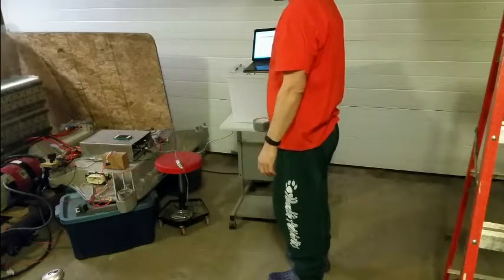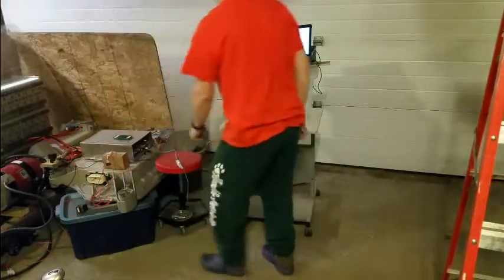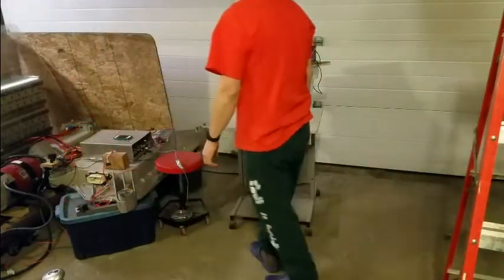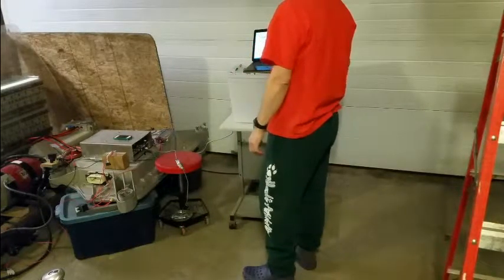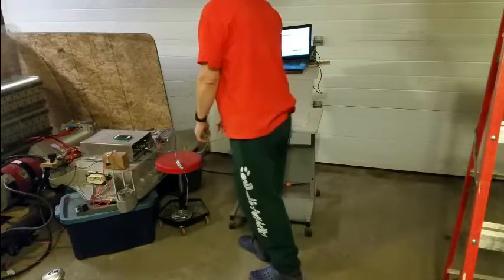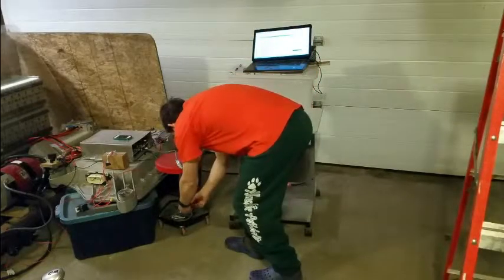I'm going to load the new firmware in now and see whether or not the AC controller works well with the throttle that I've got. I should have turned it to a neutral position according to the settings before I let it turn off. Right now, between 400 and 624 is what Paul has as neutral. So I've got 612. I can't actually get up to the positive throttle positions, but I'm going to put it a little closer to 500.